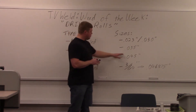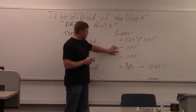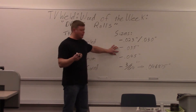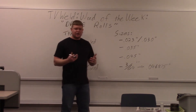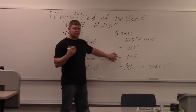Probably the most common sizes are 035 and 045. The 035 is for thinner stuff, but if you want more productivity and need more metal going down, you typically go up to 045 for higher deposition rates because it's a fatter wire. When switching wire sizes, you have to make sure you're also switching the drive rolls, otherwise it won't feed correctly.